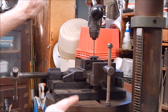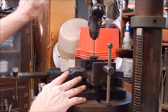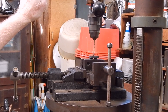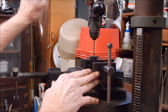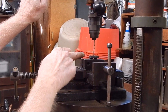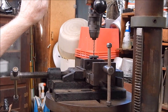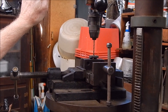This is where you want to drill a piece with a drill press and a rack if possible. Always clamp your work down, otherwise you run the risk of ripping your fingers to pieces. I'd like to have a drill vice — an ordinary vice — that way you can slide it around. This has got plain jaws and this has got marked jaws. If I want to use the plain jaws I just take that one out and away I go. I use that for milling on the lathe as well, so you can double up on all this stuff. And I use that on the bandsaw to hold difficult work.